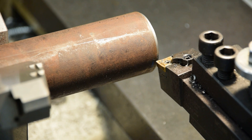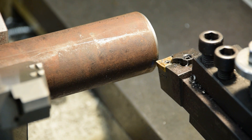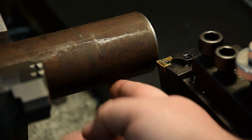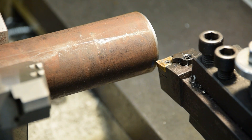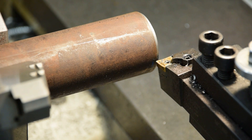This video is a chip control demonstration for John Saunders and anybody else having trouble getting a chip to break in mild steel. This is a CNMP 432 insert made by Mitsubishi. This is a 2-inch piece of hot rolled 1018 mild steel. We're going to touch off here, take a 200 thou cut off the OD — 100 thou radial at eight thousandths per rev, 600 RPM.